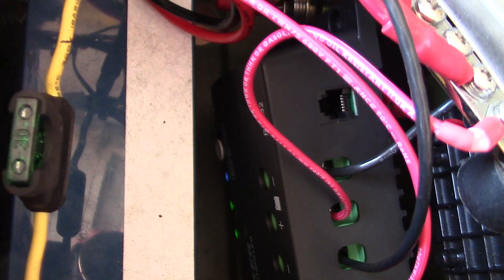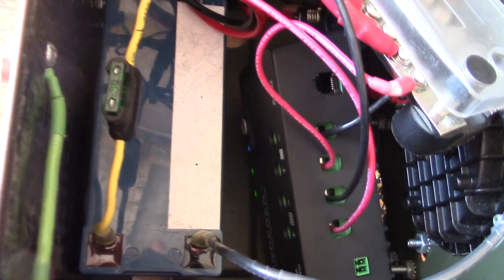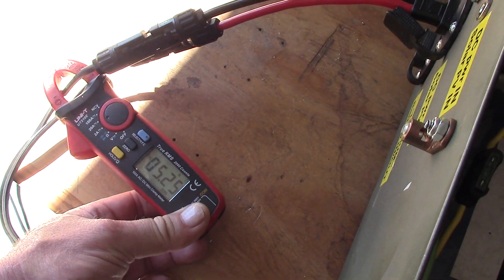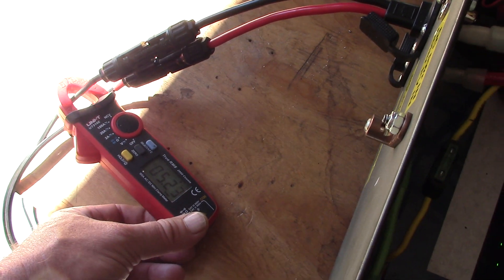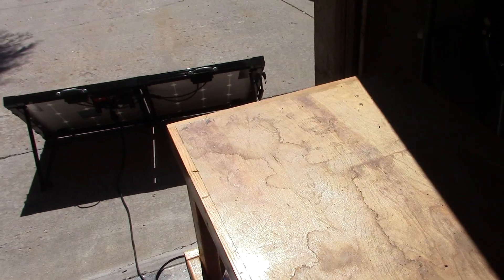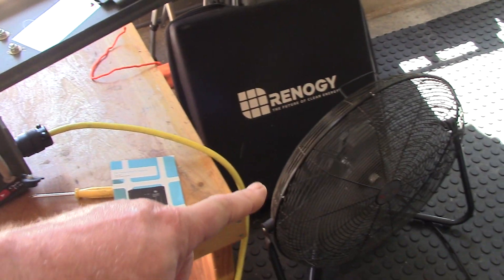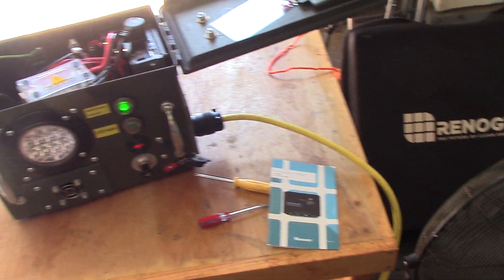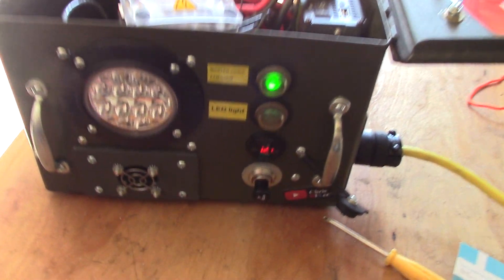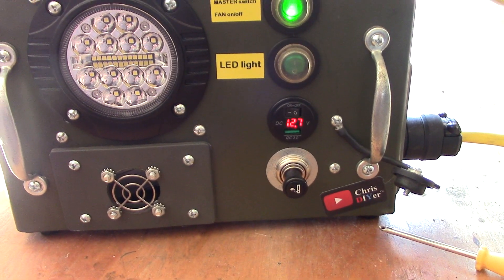There's no load output on it, so it's just battery and solar panel. That solar panel hooked up with the fan on the inverter is putting out about 5.2 amps, about 65-70 watts coming in — not enough to run the fan, which pulls about 100 watts, but this is just to see that it works and check the voltage.